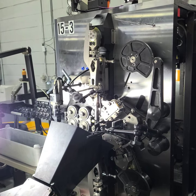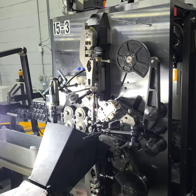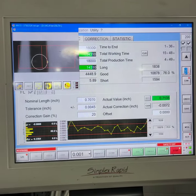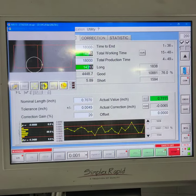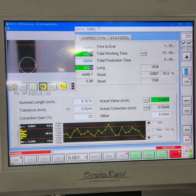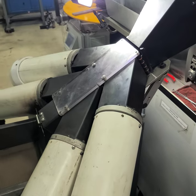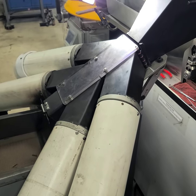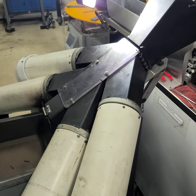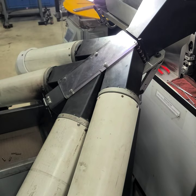For parts with very tight spring force tolerances, or part configurations that result in a high scrap rate, we initiate five-way sorting. We are able to slightly expand the acceptable free length tolerance band and then split it into three groups. The slightly short and slightly long springs enter separate stress relief ovens just like the springs in the center of the free length tolerance band. By separating these three groups and making grinding adjustments accordingly, we are able to reduce coiling scrap compared to if we just used the standard two-way sorting on these tighter tolerant springs.